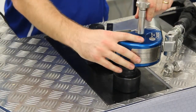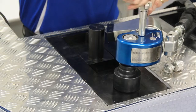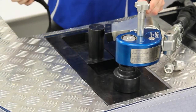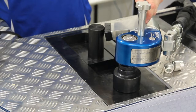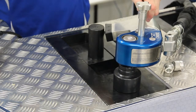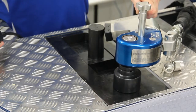Placing it back onto the socket and get the handle back in place to keep our fingers clear. Then we can go about tightening the nut. The handle keeps the tool nice and straight, holds it up against the reaction point, with no risk to fingers.